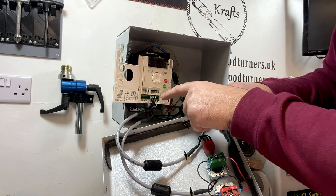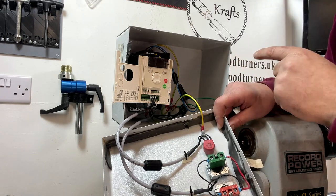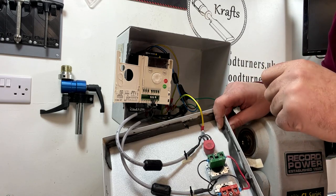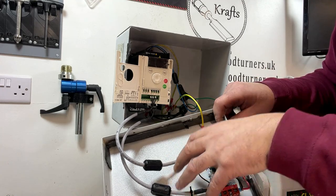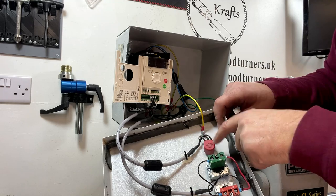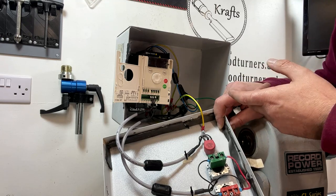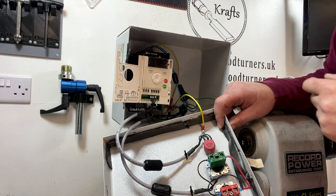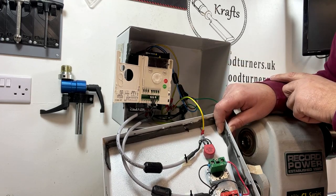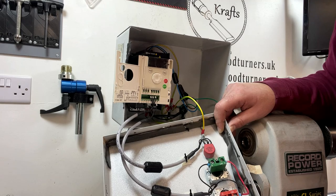I'm connecting to the switches rather than the PLC because they're easier to get to and there's room for another wire, and I don't want to mess with the delicate PLC wiring. Those wires will then run to a female socket mounted in the back of the cabinet. For the potentiometer, we've got a 5V feed, AI1, and COM wires. I'll take the 5V signal wire out and run it to one side of my switch, then the other side goes to the potentiometer on the remote.